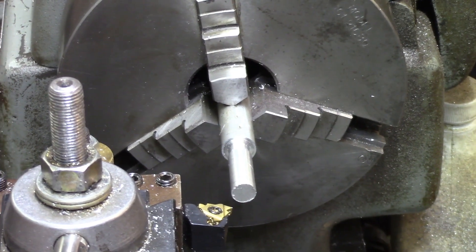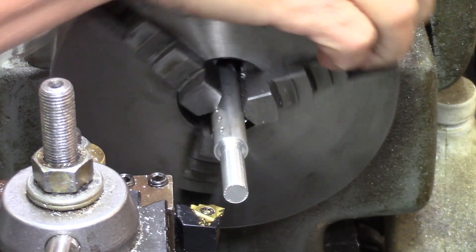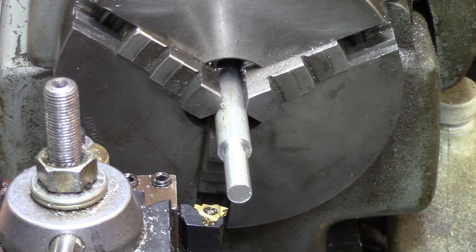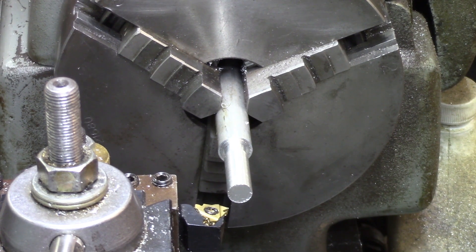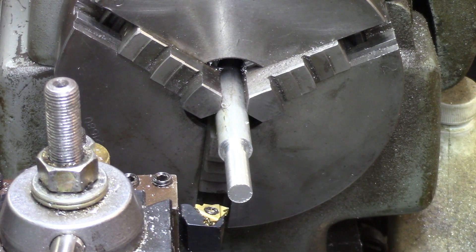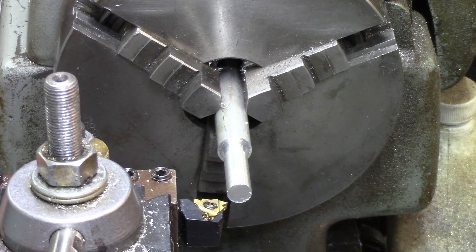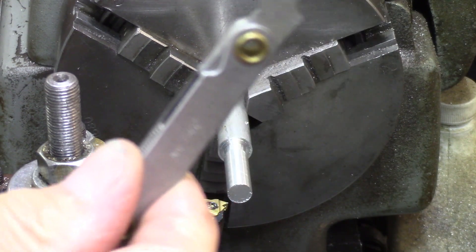I only had to use two of the gears I made — one is the 48 and the other is the 52. I think I'm understanding the instructions correctly and the lead screw looks to me like it feeds at the right rate for that sort of thread. The gears run pretty good; there's a tiny little slop in something — I can hear a little tick tick tick — but running pretty good. Let me turn down this piece of aluminum and then we'll put a threading tool in there and go for it. If I've understood the instructions, I should wind up with a 10 millimeter by 1.5 thread.